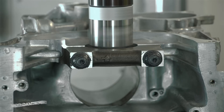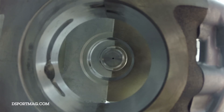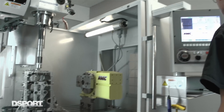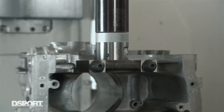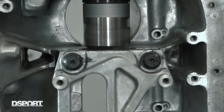Now we've gone through and made the cut on the first one, and we're just going to go through and take a double look to see where we have a contact point — if we are getting a 360 degree, which we're probably not done yet — just to see where the contact is occurring. We've offset it a little bit in the bore so that we're taking the minimum amount off of the block and the maximum amount off of the cap to achieve the desired diameter that we're looking to accomplish here. It looks like we're pretty happy with that, so we're going to proceed to the next and hopefully get a similar result.